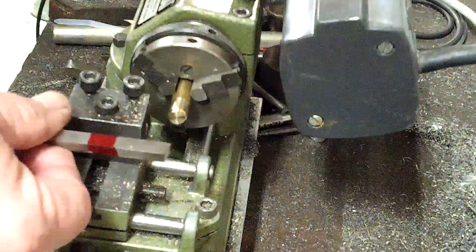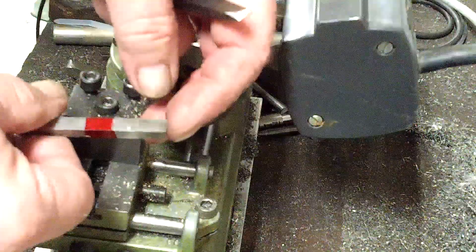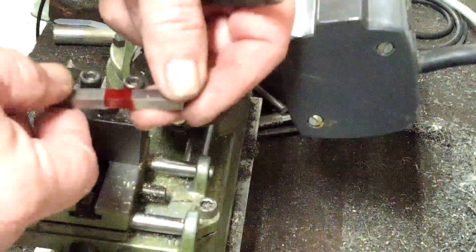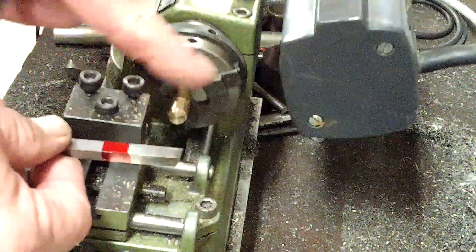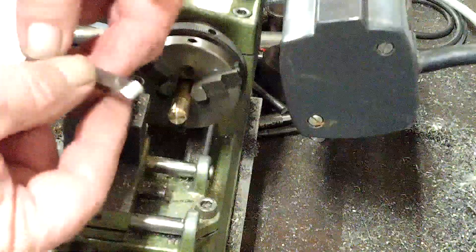The only difference is that for brass, this does not have any top rake cut into it. Otherwise it has a propensity to pull into the work, or pull the work into the tool, which is undesirable. So to that end we don't put any top rake on it.